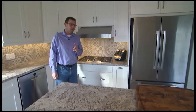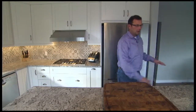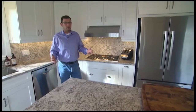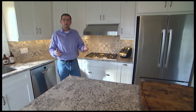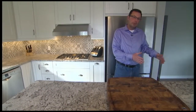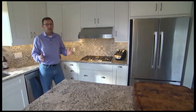One thing I wanted to mention is when you take a wall — which we did in this renovation, there was a wall basically going right across with a doorway in this area. We had to marry up the floor, so we got our good buddy Ronnie Gavin in. He came in and we were able to get the floor — the client went to the center where they had it originally and we were able to get it. He pieced it all together, and that's one thing I should mention: you don't want a simple line cut, you want to make sure he pulls the pieces out that he needs to get the floor to look and flow like it's always been together.